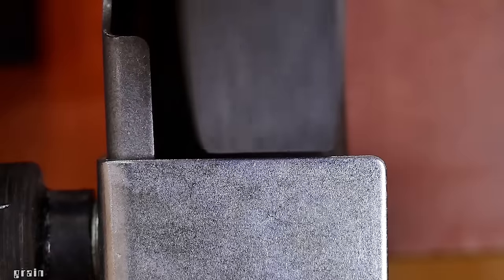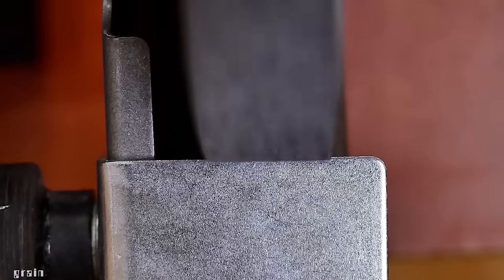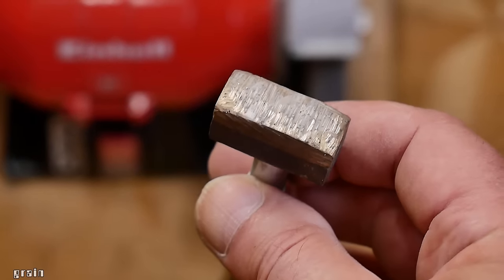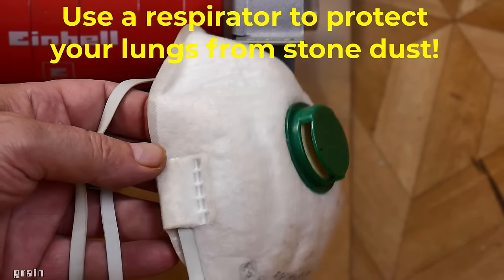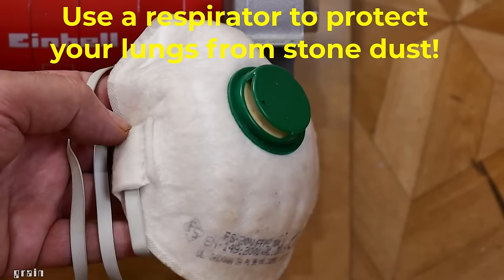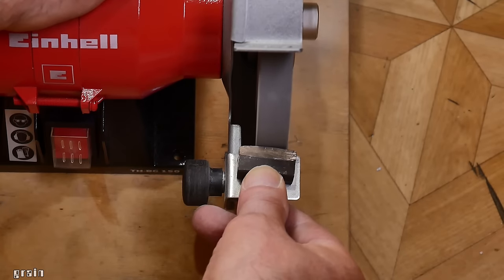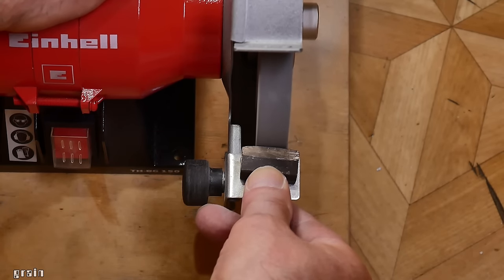This is a new disc, so its radial geometry has not been fixed yet. It is better to fix this before balancing the disc. After balancing, you can align more accurately. It's easier than doing the balancing twice. Press the grinder onto the floor with one hand using your body weight. Otherwise, the grinder will dance.